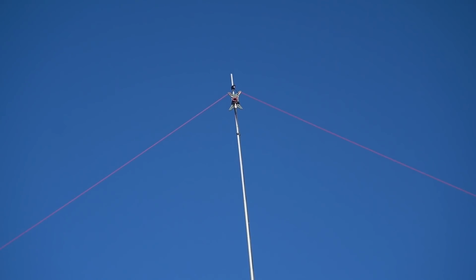You watch our videos where it's tuned, and from that you can add or subtract some wire, and your build will probably come out pretty good if you do everything that we say on how you set it up. When you set up, you don't want to set up your inverted V like this. It wants to be 90 degrees or a little bit more. We'll measure out the guying line that guides the end of the antenna out, and it'll be the same every time, guys. That's the way you get your antenna tuned. You tune it the way you're going to set it up.